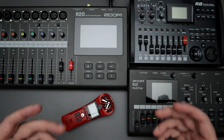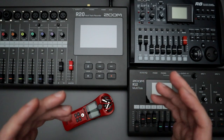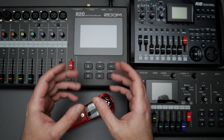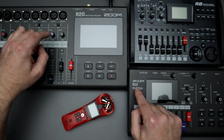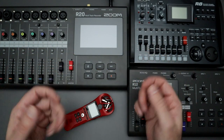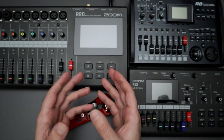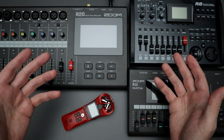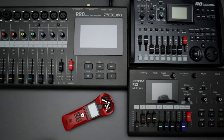I like to watch Floyd Steinberg's channel on YouTube — he's always tinkering and building something out of a Raspberry Pi board. In the spirit of that kind of video, I was trying to come up with a condenser mic solution that wouldn't have any excess cords, would be very compact, relatively cheap, able to run off phantom power from the R12 or R20 or any mixing board providing 48 volts of phantom power, and would be omnidirectional — so I could just put the device down in the middle of a room and it would pick up all the audio around it.